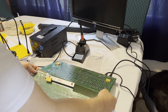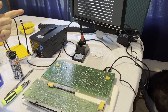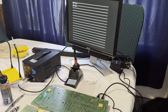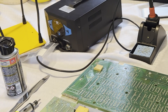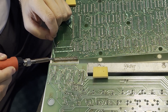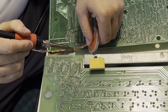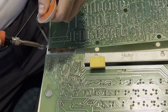I did a little bit of jostling around, and this time I get the basic prompt. It isn't working quite right, and the video isn't quite working right. So I think what I'm going to do is clean up the solder joints along this ribbon cable here, because there's all kinds of flux left over from a previous repair job. I'm going to soak that thing in some proper rosin flux before getting all that excess solder off of there.